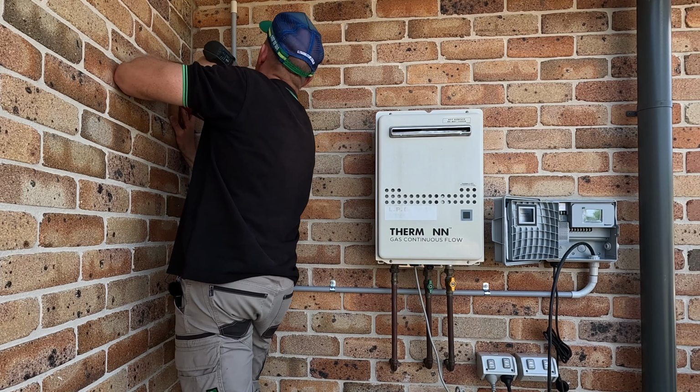So we've got our common, which I'll explain in a minute, MV, which is main valve, which is, I think you might remember, I've got 6 valves and one extra. So that's the main valve there. That one will always turn on when a zone is on. So this could be zone 1. So we might make the Zoysia here zone 1. And these ones will wire up, which will be the front yard as we progress down there.